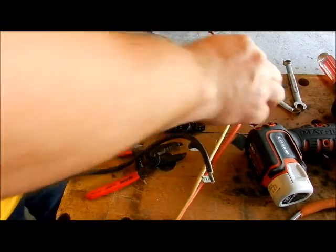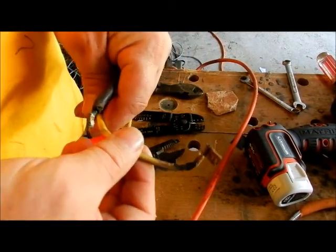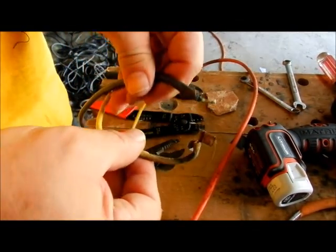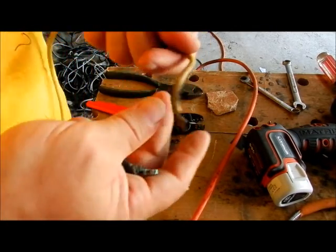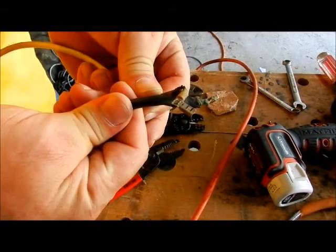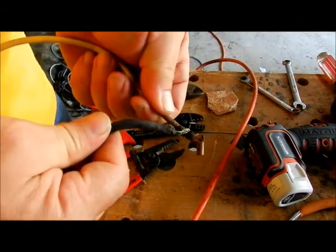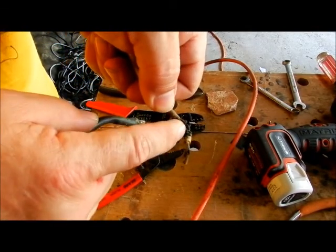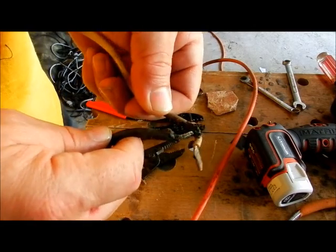So I want to show you something here, though, with the yellow wire. This is the burnt area. So this was on the bottom. I think it was mounted like this. This came underneath and was hooked up to the black. And so when this broke off, it was sparking right there. That's the wire right there. That's something wire to wire, and that's what was popping the breaker.